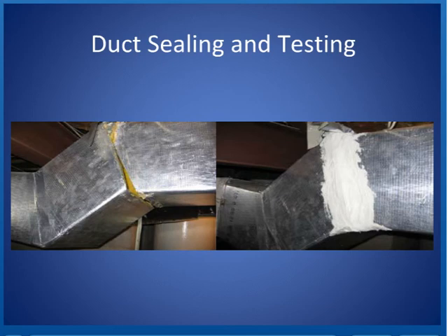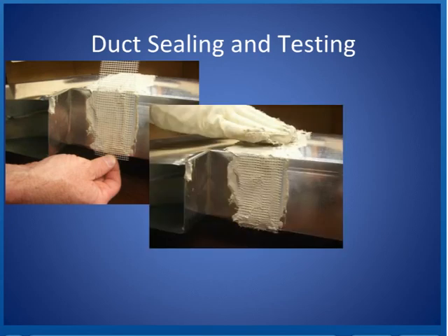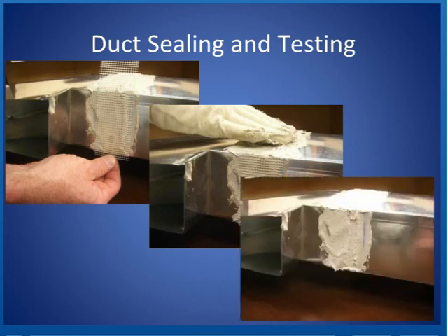Well, what the heck is fiberglass tape? Fiberglass tape — you put some mastic on the duct to give it a place to stick to, and then you wrap the duct with the fiberglass tape. When you wrap it all, you make sure that it's good and sealed and pushed down, and you let that layer dry, or if you're impatient, you move on and put the next layer on — and it looks really thick on there.